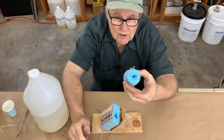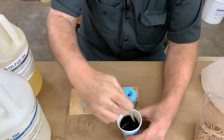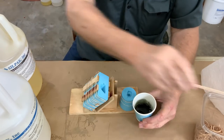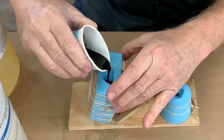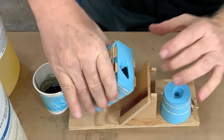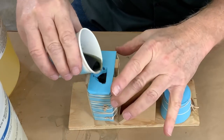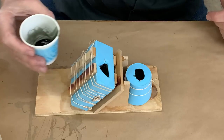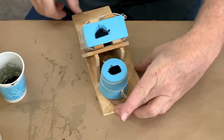This is the other mold — it too is ready to go. I mixed up a 40 batch of QuickCast, and it lives up to its name, so we shall not dilly-dally. This should pour in a straightforward pour, no problems. I want to see if I get that air bubble out of there — got some bubbles out. Shaking it all around. It rolls up perfectly, right up to the top. They look good — let's tank them up.